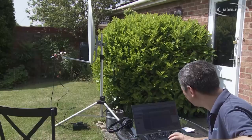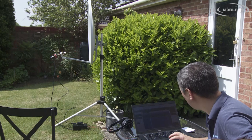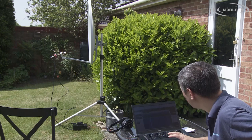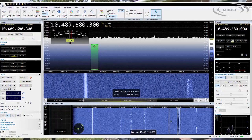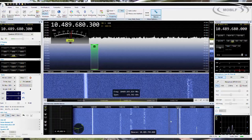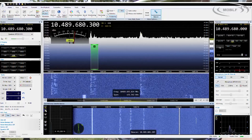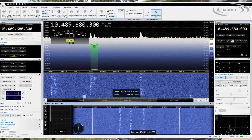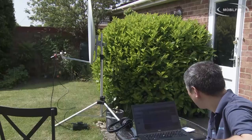Now we need to correct any drift in the LNB by locking SDR Console to the PSK downlink beacon — the beacon in the middle of the SSB spectrum. Click on the geostationary beacon in the view tab, and a small block opens at the bottom of your screen showing the PSK beacon, at about 10489.800 for me. Press the play icon to lock everything — you'll see the frequencies on the top half of the display all shift. This corrects for the drift of the LNB, and as long as nothing drifts too far, it will stay locked. That's about it — let's give it a go.